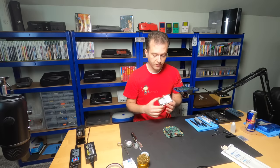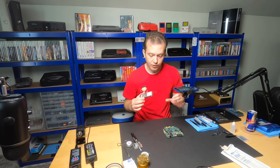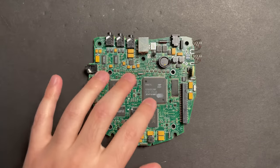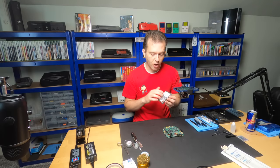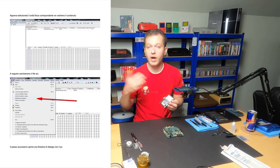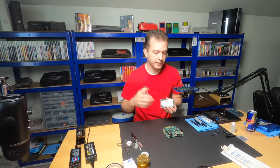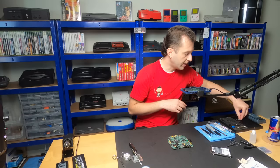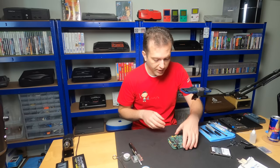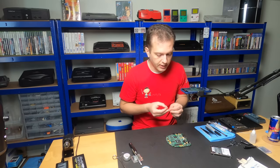Stefano's guide includes instructions for swapping out the original hard disk with a compact flash card or even an SD card. But you can't just swap in another drive — there is a proprietary bootloader that needs to be copied over from the original drive to the replacement drive using a hex editor like WinHex. I'd love to see if this drive still works, and if it does, hopefully there's some music on it. It'll be a time capsule of whatever the previous owner left on there.